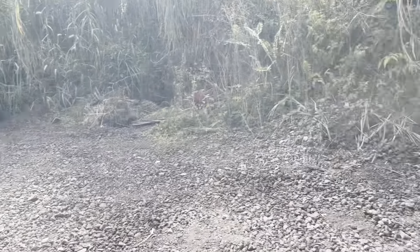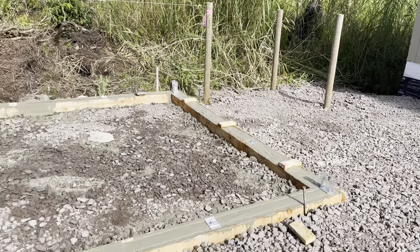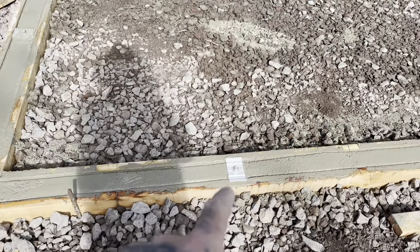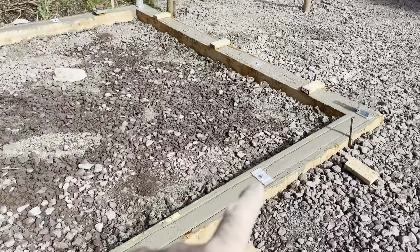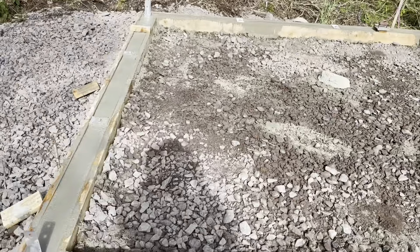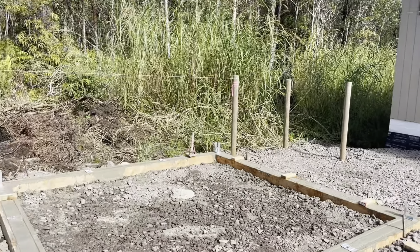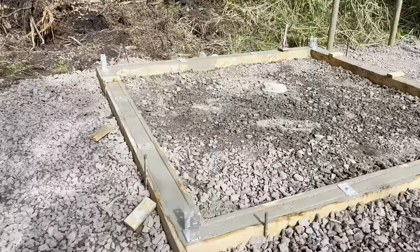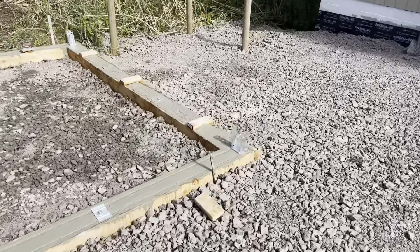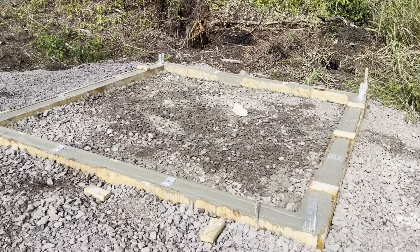I'm going a little bit more protective on this coop than I did on my first coop. Rats ended up chewing on the automatic door on the other side - the bottom was just wood, so they chewed the wood and got into the coop. It wasn't to go after the chickens - it was because I used to put feed in there when I first got my birds. I have all my corner pieces in. Where these little plates are, that's a piece of threshold I had left over, cut into eight pieces, and those are J-hooks. There will be a 4x4 bracket bolted there as well. Everywhere where there's an anchor, there's going to be a 4x4 going up. This is basically going to be a 4x4 structure all the way around with 4x4 crossbeams topping everything, and then I'll put on my roof joist. This video I'll probably close out soon, but putting in the 4 corner posts will have to wait until tomorrow so this concrete can set up.